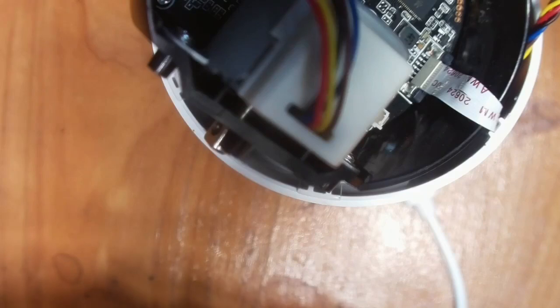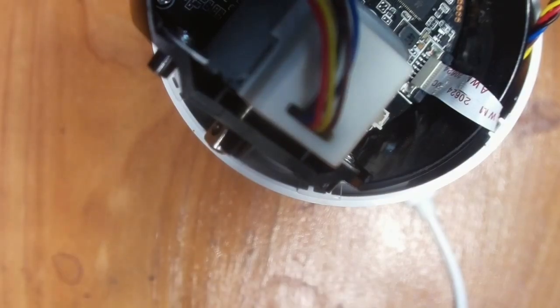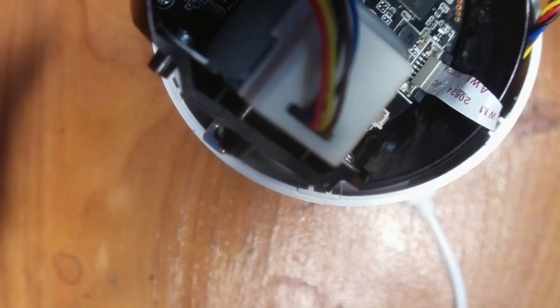That's all you have to do, but we're going to wait and make sure everything comes up. It's a fairly quick process — not a large flash chip on here, takes about a minute or so. If you got it, it'll do everything automatically. If your timing was wrong, just rewind the video and do it a second time — it can be a bit tricky your first time. If you heard that, that was the IR cut, and you can see this motor has moved. So it's doing the sweep. Now let me reassemble this — we're going to be right back to provisioning.